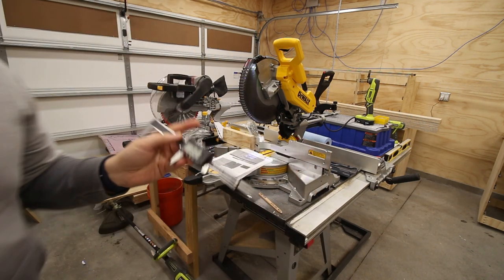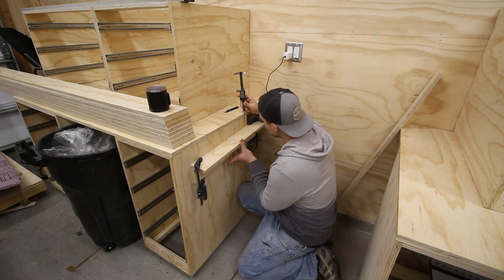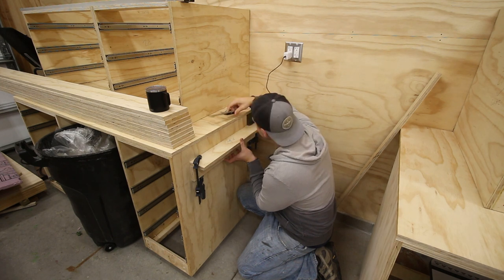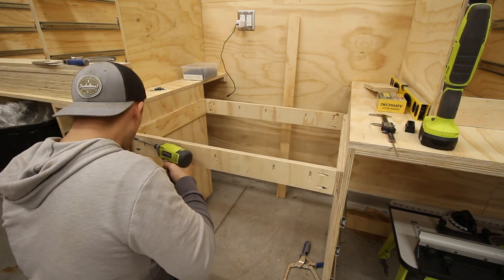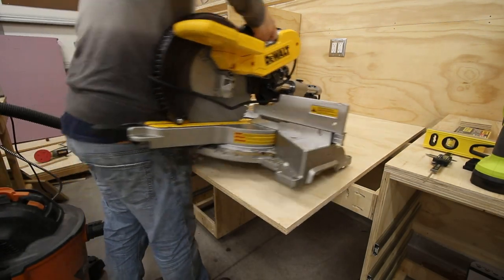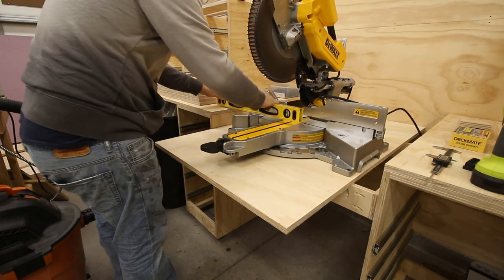So with my new saw in hand, I measured the height of its cutting surface using the back end of my digital calipers and used that measurement to secure the miter saw station base frame to the sides of the base cabinets. I made a makeshift jig to reflect the fact that the height I was measuring included the miter saw's work surface, not just the underlying frame. I thus made my marks on the bottom of said jig before securing the side pieces of the frame with a half dozen screws on each side. After the back and front frame pieces were installed with a few pocket screws, I could confirm that my careful measurements had resulted in a saw surface that was perfectly flush on both sides and level.